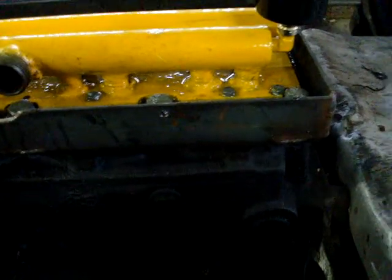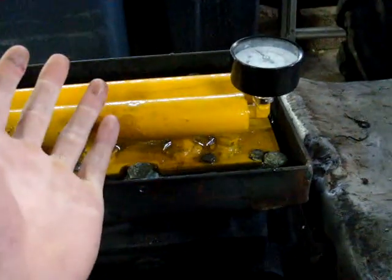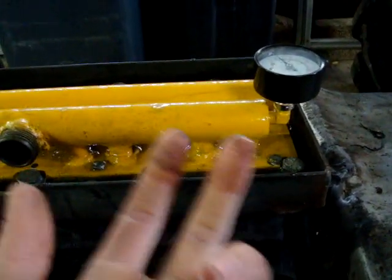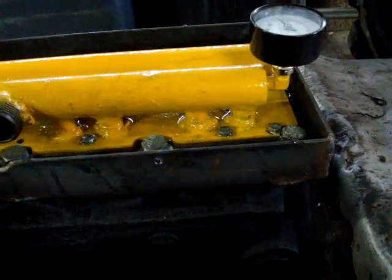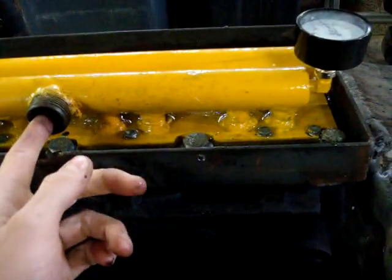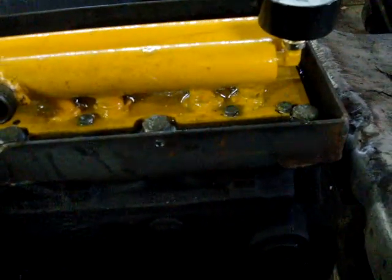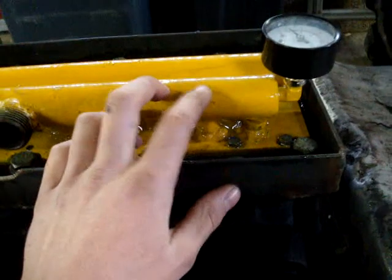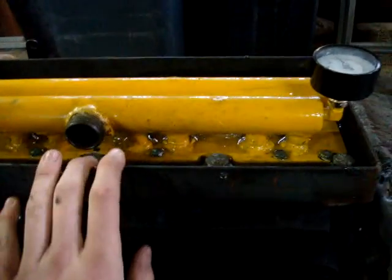When it gets to the bottom of the stroke and starts going back up again, those valves get pushed up onto their seat, and so they seal off. And then the valves on the outlet lift off their seats, because as the piston was going down, the vacuum was acting on them and sealing them, kind of. That also, and the air pressure already built up from previous strokes, was acting on them, sealing them off as well. So when the piston comes back up, these inlet valves seal, and the exhaust valves lift off their seat and let the air out. And so that's how it works.